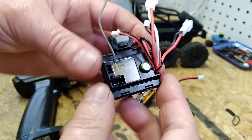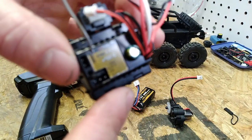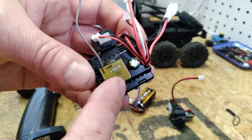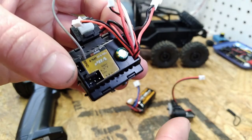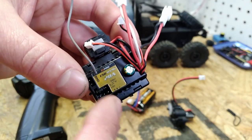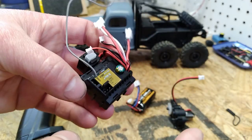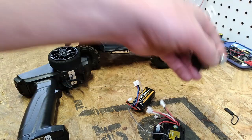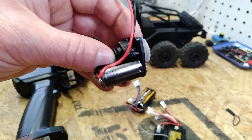You could hear the noise that this ESC was making whilst trying to run that motor. It's a well-known fact that this ESC is kind of cheap and noisy, but what nobody talks about is that while it's making that noise and struggling to get the motor started, it's actually imparting heat and making the motor run hotter than it would with a more efficiently designed ESC. Something about the pulse width modulation that this particular ESC uses just heats up the motor. I proved that point by replacing it with another ESC I had lying around.